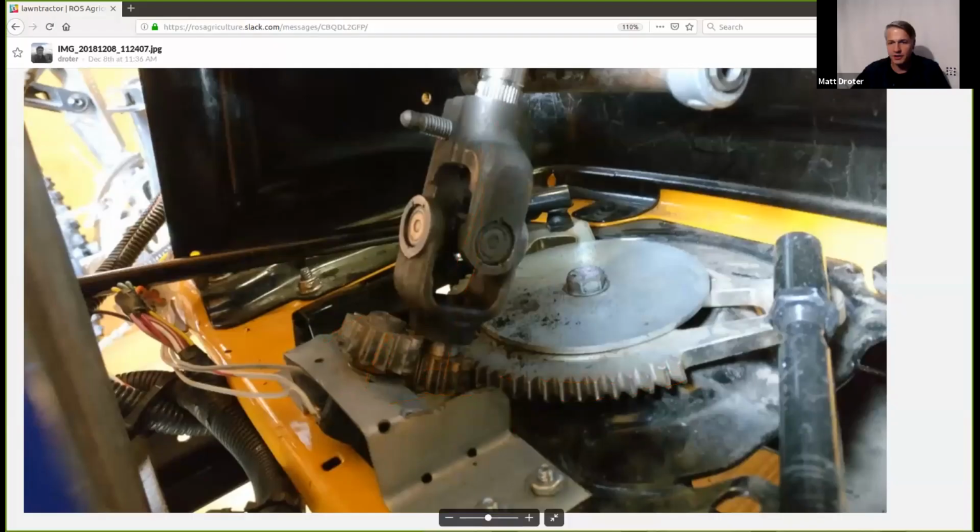Do you still have one of those automotive Hall effect sensors, like the level sensors, that's got the arms sticking out? You broke it? Broke it. I originally attached it to these arms. You can actually see the mounting hole over here, and then it had that swinging arm that came down here, and then I attached it to this bar. But this bar traveled more than the sensor could rotate. Now, if I would have drawn that out in CAD and measured the angles, I would have figured that out. But I did that experimentally and tore that thing right in half.